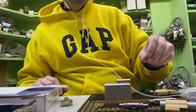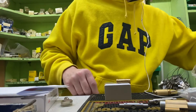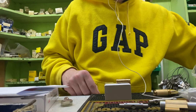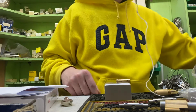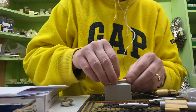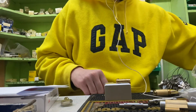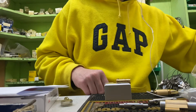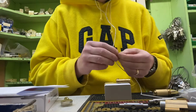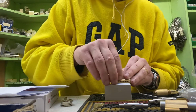Right, so now that we've got our springs in, I'm just going to take out the number one slider, because there's no number one slider in this combination. So we've got a combination of 2, 3, 5, 6, 4. That's our number 2. I'm going to make these barrels all on the same key for the client's convenience. We don't charge any extra for keying up the EVVA modular cylinders, since we've got to build them anyway.